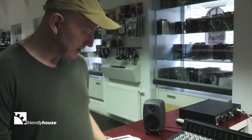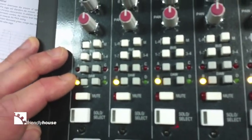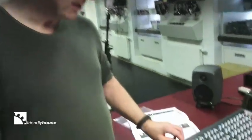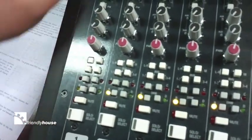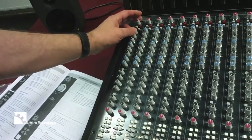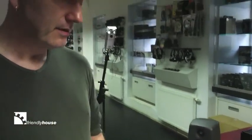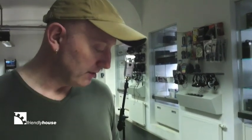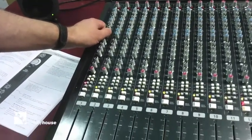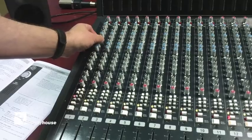The advantage we have in this desk is these buttons here — we have four buttons: A, B, C, D. These buttons allow you to set how the channel strips interface with the DAW. For example, when the A button is in the up position, the channel will be sent to the DAW direct from the preamp — so you have preamp and high-pass filter. The EQ will be listened to in the control room by the engineer independently of the recording. If you press the button in, then the EQ will follow the send, meaning you can insert a really high quality EQ onto your recording feed.